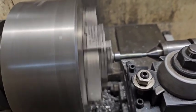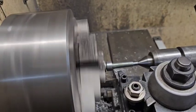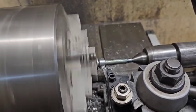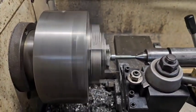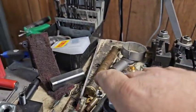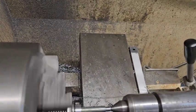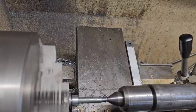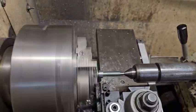I'm going to call that good. Oh, there's still two flat spots on it — take one more pass, see if I can knock it down. There we go. See that ribbon coming off there? That means we're getting all of it. Now I want just a little bit of chamfer on it. I'm going to put just a little chamfer on it, and that's it.